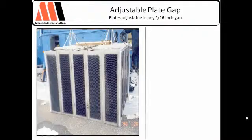On the next slide you'll see a typical 600 GPM coalescer. Here's one with the standard plates in place — every other plate — so we've got a one-inch gap, real high efficiency. This is an all-stainless-steel pack used at about 180 degrees Fahrenheit. Years later, still looking really good. With every plate in place, you get 45 micron removal — about the highest efficiency available in the industry.